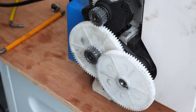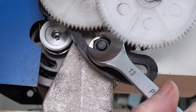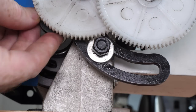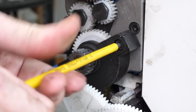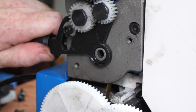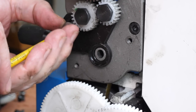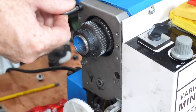Removing the screw on the central gear doesn't seem to make anything easier to remove, so I need to look for other options. While I can't easily remove the gears, loosening this nut allows them to be moved down, disengaging them from the gear above and making room for the rest of the mechanism to be removed. With the lower gears out of the way, this central mechanism can be removed in one piece by removing these two screws. The feed direction lever is now completely exposed and only held in place by this last screw. With the top part of the gear train removed, I should be able to get to the drive mechanism by removing this panel.